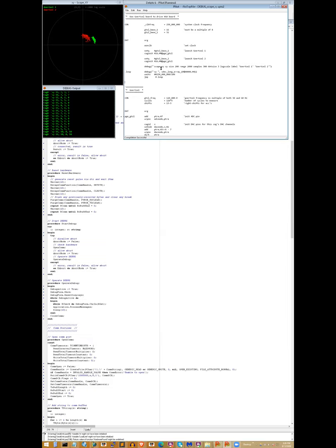Chip, what was the purpose of the labels Goertzel one and Goertzel two? Just so you know that the first channel — they're color-coded. The green is Goertzel one and the red is Goertzel two. It's your color legend so you know what to look at on the display. There's an automatic color sequence — you can override it, but there's an automatic sequence of color assignments that go through different channels. This rotated display or XY display is kind of dear to my heart because I've always wanted to do a lot of signal stuff, and circular functions are where it's all at. This display is really good for observing cyclical phenomena that involves circles and rotations.